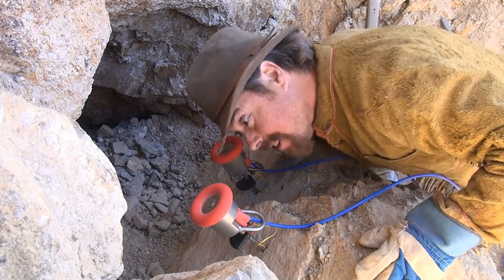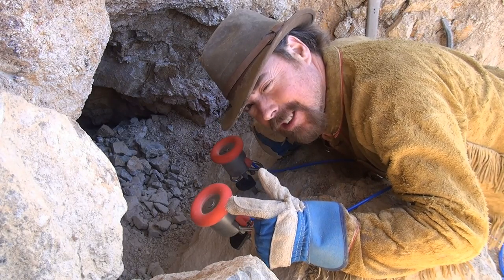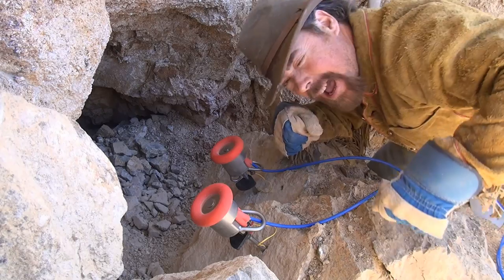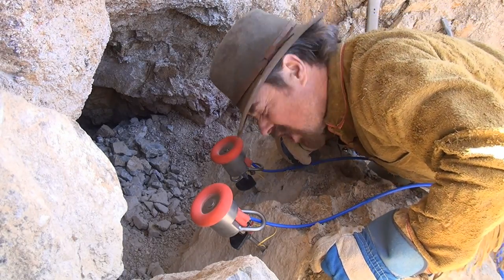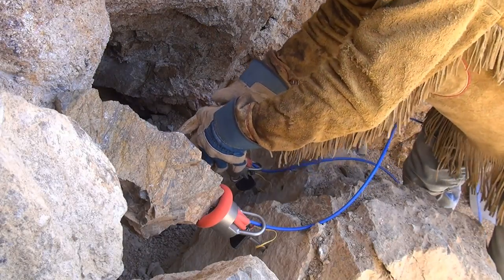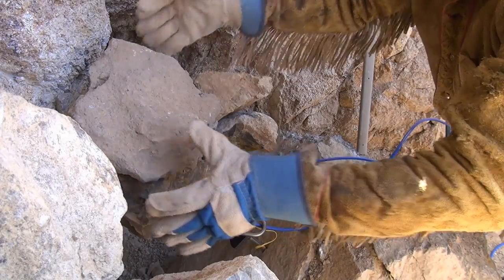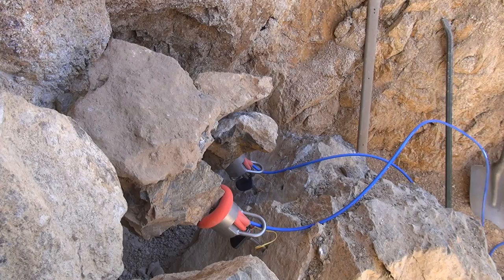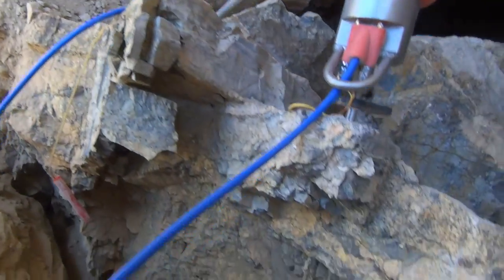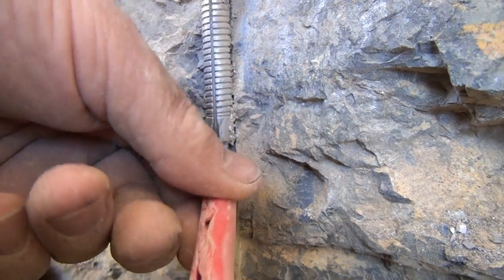I've got my heads in there — one head, two head, three head. You should always try to put weight on top of these. I'm going to lean some rocks on them so it compresses the head into the hole, because when it goes off, the more compression forces the blast down through the rock. If not, you'll just see them pop up a little, and that's no good. Let me get some rocks on here. Okay, let's see what happens — fire in the hole! Look at that. Let's take a look — I know you're thinking it didn't go off, but there's my bore hole and if you look in the back of it, see where it ruptured? That one went off good.